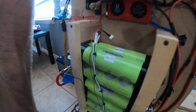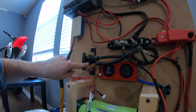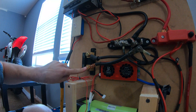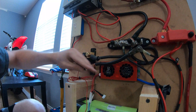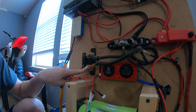Here is the connection to the smart shunt, which keeps track of amp hours going in and out of the battery. To keep it accurate, we have to hook the battery up on the negative side here, and then hook it on the positive over there. So wire there, wire there, zip tie it together — then we'll put a big plug on it.